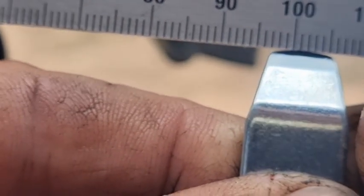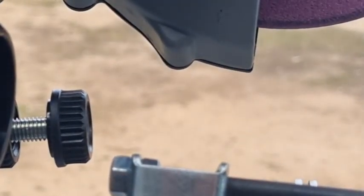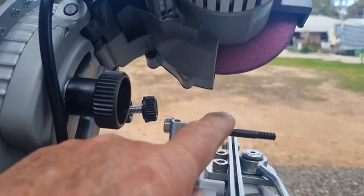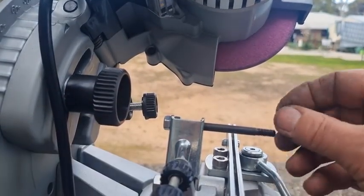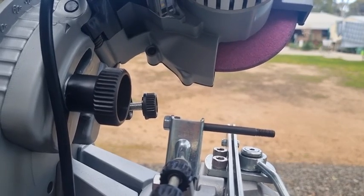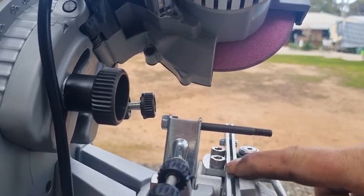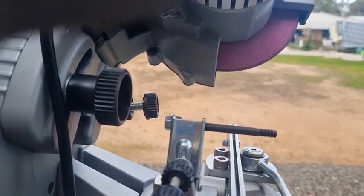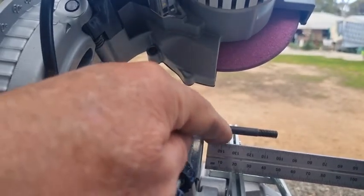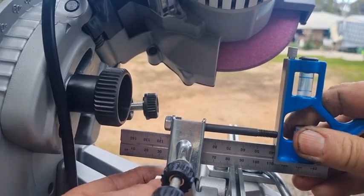You can see the radius — there it is — that's the one that can cause the problem. So with a combination of this bar being a little bit up or down — it's got to be perfectly horizontal — and this edge here, if you put a square on here, then this distance needs to be equal.